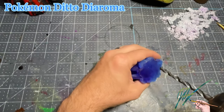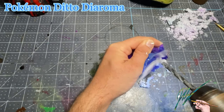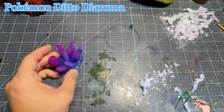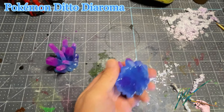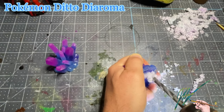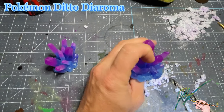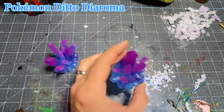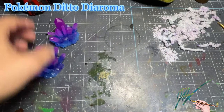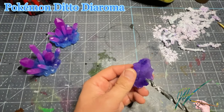I will later on have to order some 9 volt battery packs. I already do have some 9 volt caps to go on top of them, so I can get by for now. But you've got to remember, I'm also going to design a lot of these projects so that they have the capability to have a 5.5 battery pack connected to them from an electrical socket. So you can either power it with an electrical socket or with a 9 volt battery. Obviously, you wouldn't want to have both of them powered at the same time. The electrical circuit would kind of destroy a 9 volt battery. But you would have the option to use either one, depending on which one you plug into the 5.5 female prong of the power system. So you'll see that reappear in video number 2 as we get to those stages.